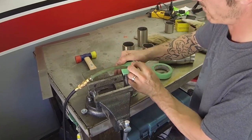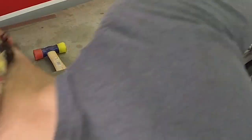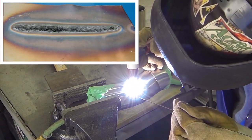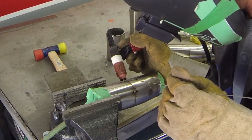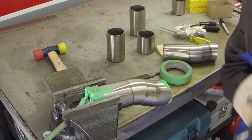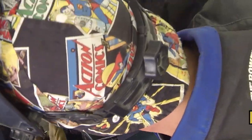For final welding, things get done a little bit differently. You'll notice a hose being taped into the tube — that's called a purge line, and it's necessary for butt welding stainless steel. When stainless melts, it becomes very sensitive to air, so much so that if you're not careful, it won't even be stainless when you're done. Unlike the lap joints on the mufflers, the ends of these tubes are butted up against each other. A proper butt weld will melt through the entire thickness of the tubes, but the argon gas coming out of the torch will only protect the outside of the weld. The purge line floods the inside of the tube with argon, displacing the harmful gases found in air and protects the weld from contamination.